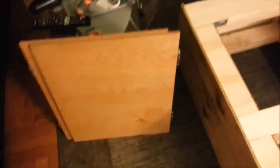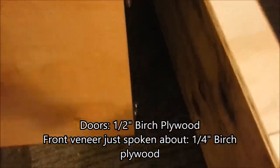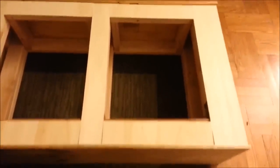I'll probably nail it in on a weekend since it's really loud. For the doors, I got the hinges on, measuring four inches from the top and four inches from the bottom, pencil-marked it, and screwed them in. The screws that came with the hinges don't pop through, which is good. Next steps: nail everything in, sand with 220-grit, stain once or twice, then apply two to four coats of polyurethane. Then screw the doors on and it's pretty much done.